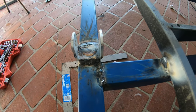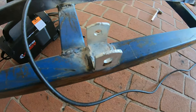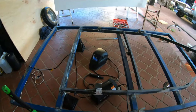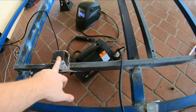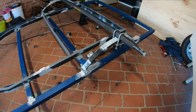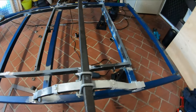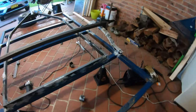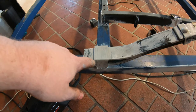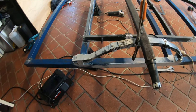The front hanger is on both sides. Now I need to do the spring hanger on the back, then cut off all the old ones and grind off all the welds. All right, the springs are on. I'll put the axle on and see how it sits. I'm using 3mm 50x50 RHS for the slipper holder, which works perfectly — fits absolutely perfect.